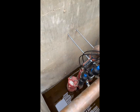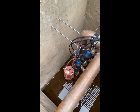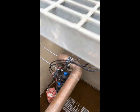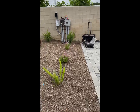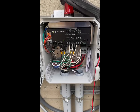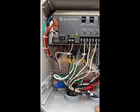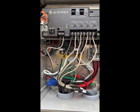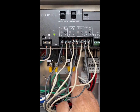To go over it quickly: you have two pumps — one leading, one lagging — and you have four sensors, those are floats. When water rises it will trigger them, and right there we have a control panel for both pumps, each one has one. I just wired this; the wires were pulled but the connections were not made, so they called me to make the connections. This is pump one and this is pump two.